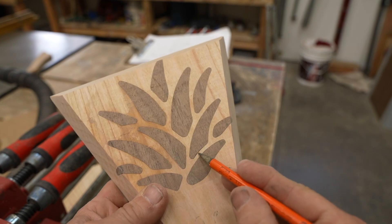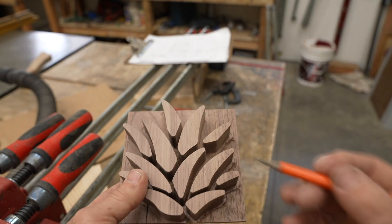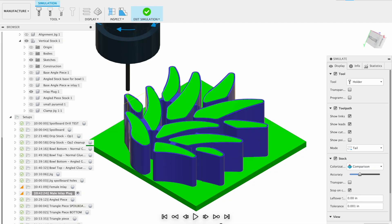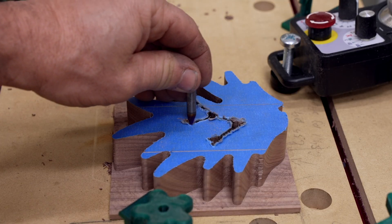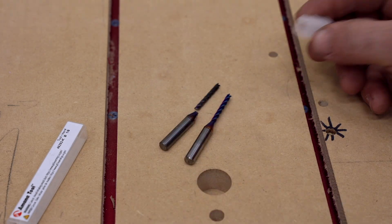Now I'll talk about the glue up process in just a little bit. Pausing and zooming in, I can see there's just a little bit of a gap, and I realized the plug was kind of wavy. The roughing tool pass wasn't removing material in this tight gap, so the finishing pass was doing a full depth cut — over one inch with an eighth-inch diameter bit — which is just too stressful on a bit like this and caused it to wave. I could correct this by doing a couple of step downs on the finishing pass, which fixed the issue. But even after I fixed the problem, the bit broke, probably stressed out from burning and doing a bunch of full depth cuts.